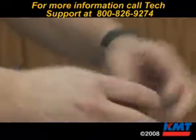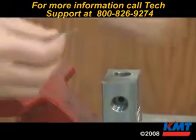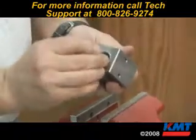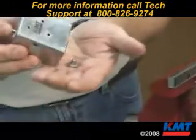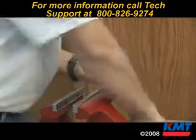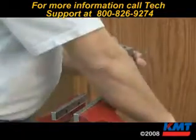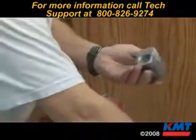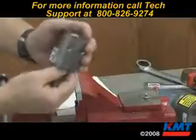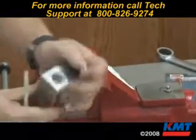Now if the seat is still in there, which it is on this one, take the old stem, stick it back through the top, through the seal assembly, push the seat, and it'll fall out. Then you can remove the stem again. The seal is still in position, so we want to take the little push tool, push the seal out, and remove it.